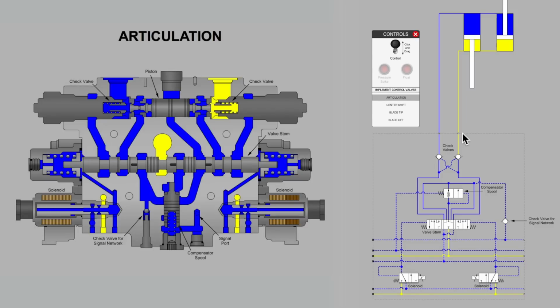If we're worried at all that there have been any issues with electronic control problems, where perhaps some signal continues to be sent to the pilot valves that may have left the spool in a partial drive position, quite often that can be easily eliminated by disconnecting the connectors to those valves and killing off any electrical signal altogether, and finding out if the cylinders still move out of position at that point.